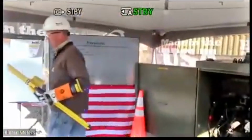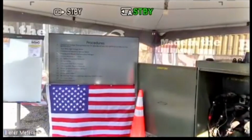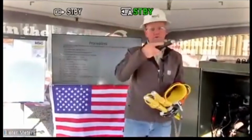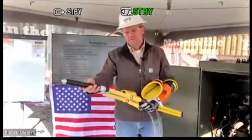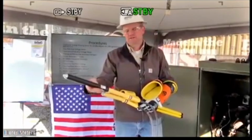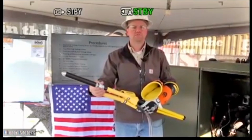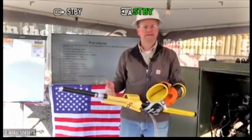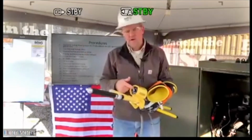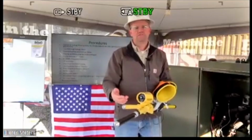The next one is DC voltmeter. And again, I can use my DC adapter, my 100-volt adapter. So when we were ringing out the line earlier, and this would be no different from checking batteries in a substation. If you want to use your truck battery as your known voltage source before you use the tool, you can do that. So you should see your 13 or 14 volts, whatever the truck battery is. I want to leave the tool in the 2 kV switch position since this is only 100 volts.